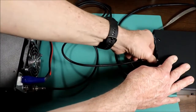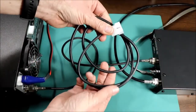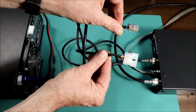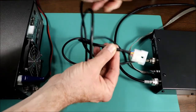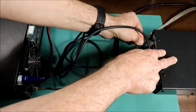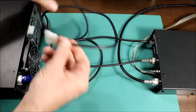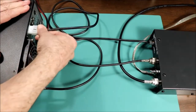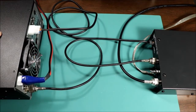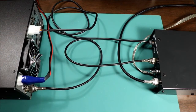That gives you your RF between the radio and the tuner. The other connection that you need is a cable to go from the tuner connector to the ICOM external antenna tuner connector for tuner control. Each tuner comes with a cable that has appropriate matching connectors. You simply plug the appropriate connector into the tuner end, and then you plug the other connector into the radio. And that's pretty much it. Now let's get this all put back in the rack, connect up our ground, and see how this works.